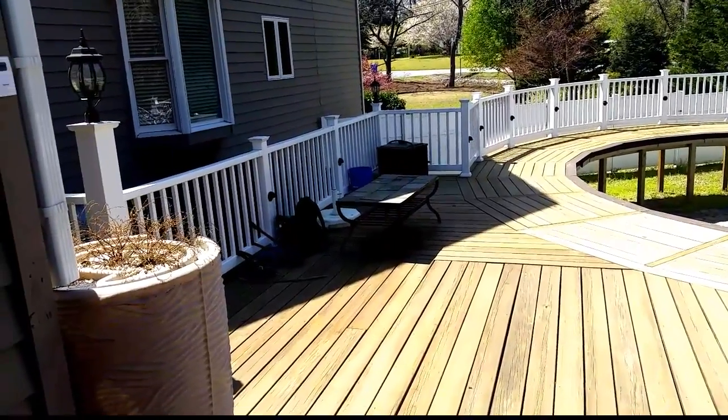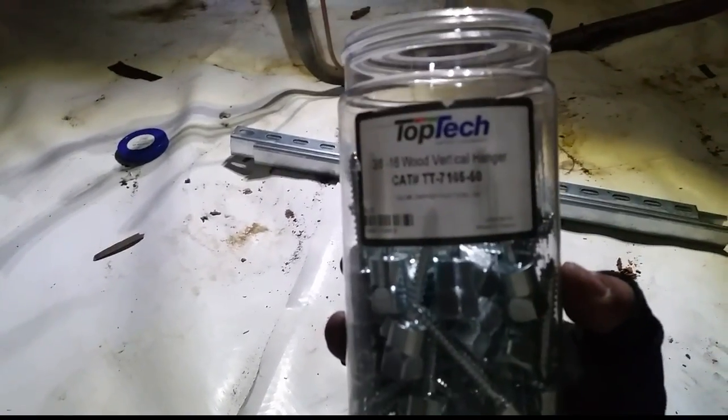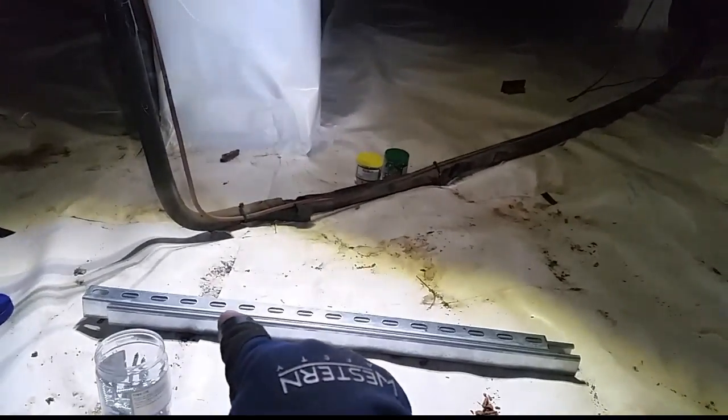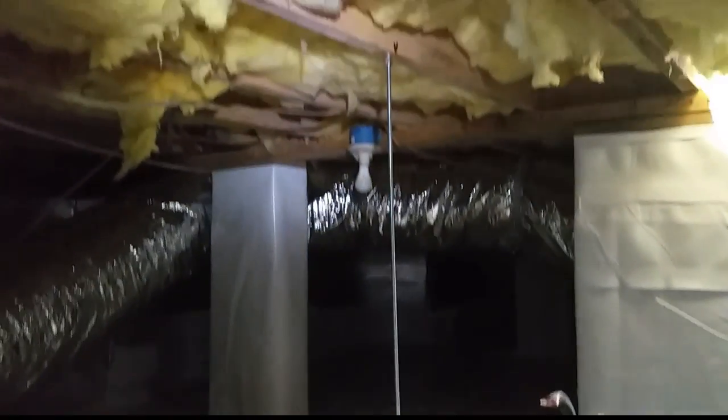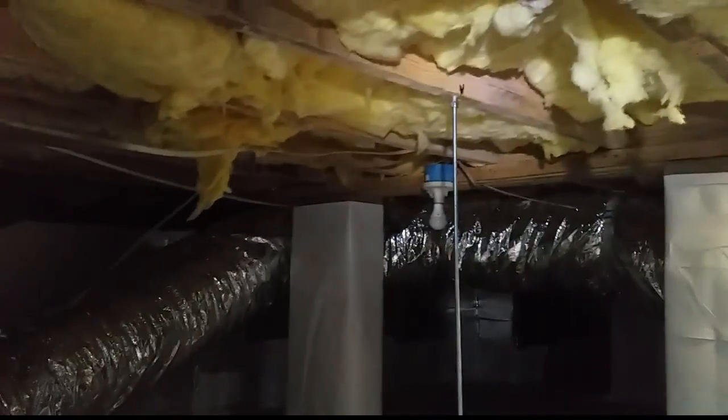We're preparing to hang the air handler. I call them 'sammies' but the correct name is Top Tech wood vertical hangers for 3/8-inch all-thread rod. We have four all-thread rods going up, and beneath the air handler will be unistrut hangers — one on each end, and then two long ones running underneath the unit. We'll put cork pads on top of those to isolate vibration from the floor. This works well in tall crawl spaces where you want that rise to get proper drain fall.